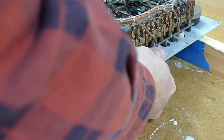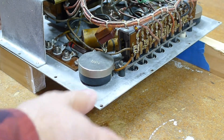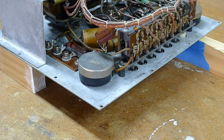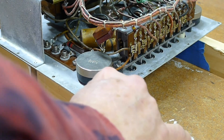I'm setting the capacitor analyzer back up on the blocks, positioning them so I can take a punch and knock the rivet through the hole to free up the bracket. I put a block on the corner leaving a gap where the rivet is so I don't risk bending the metal when I tap it out. The rivets actually came out very easily — just a couple of taps and they popped right out.